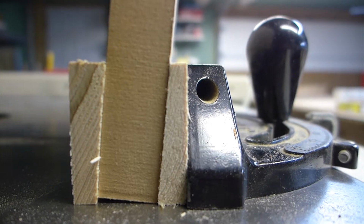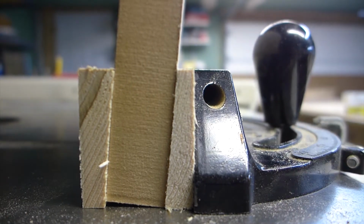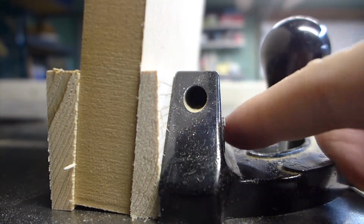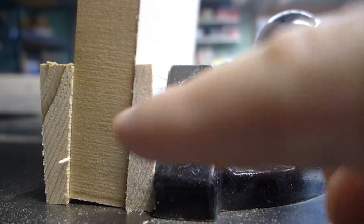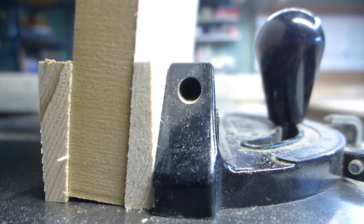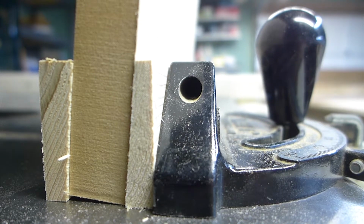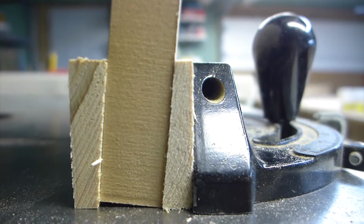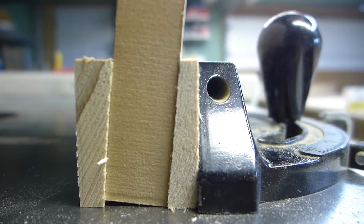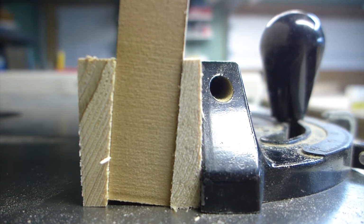There we go. Now I've got a flat clamping surface here, and it leans in a little bit, but it's close to flat. I've already got screw holes in my template that are square to the template, so drilling a hole at a slightly different angle than the one that's in there already, I'm not sure how secure that would be. So at least at first, I'm going to try just using a clamp and seeing if that holds it firmly. So this will give me 6 degrees in one direction, and then I'll just flip these blocks around, and it'll tilt 6 degrees in the other direction.